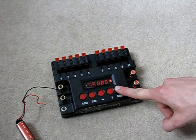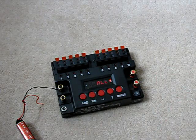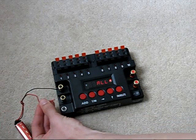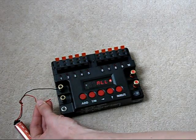If I now clear this and put it into all-fire mode — all-fire just means that every cue will fire when the system sees a voltage pulse — if I just give it the pulse, you can see that each time I touch the terminals, all the cues are firing.